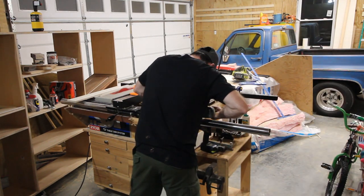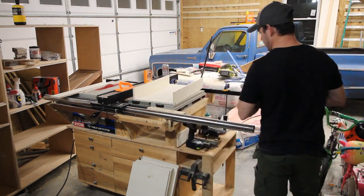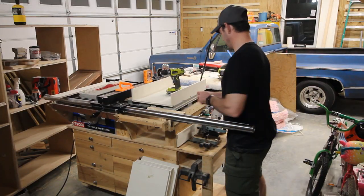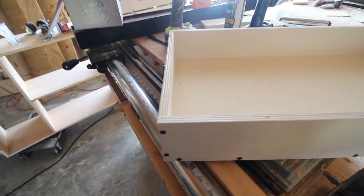I had a couple of challenges. You can see the pantry in the back left of the picture — I had it arranged to put the drawers in the upper right-hand corner, intending it to sit about 12 inches off the floor to clear a baseboard. But there was an outlet about 16 inches high on the wall. I considered cutting a hole in the back and using a French cleat, but that would recess the outlet too far. It was way too complicated, so I just simplified the approach.